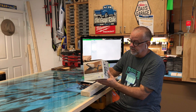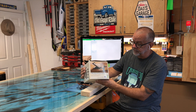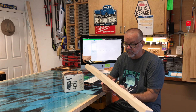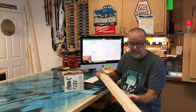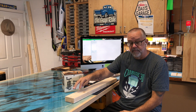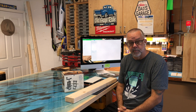Rockler has these four-way equal pressure panel clamps that you make yourself. About one two-by-four will give me three 30-inch clamps that'll work out perfect for my flags. I've got the two-by-fours cut to length and used the CNC software to design all the holes — five-eighths inch holes spaced two inches on center all the way down. Then I'll just cut it in half on the table saw and that's what makes your panel clamps.